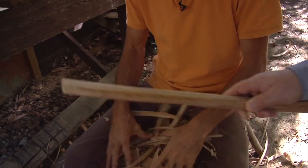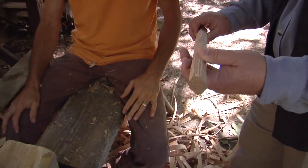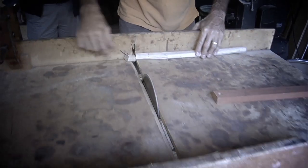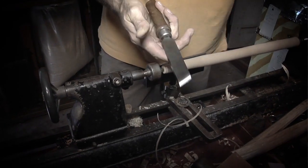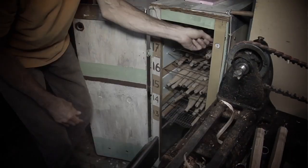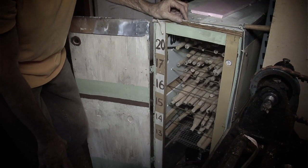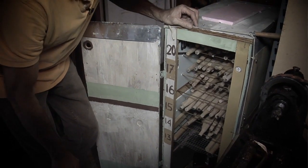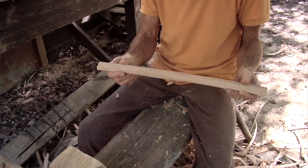It's also fresh and wet — it's green. The next step would be to cut it to length and turn it while it's still wet on my lathe. Then I'll get a bunch of parts, put them in a heated dry box to make sure they shrink as much as they're going to, and then I'll turn the final dimension on the tenons.